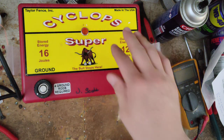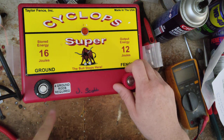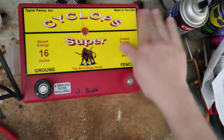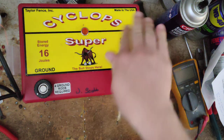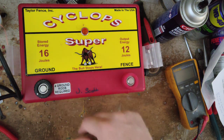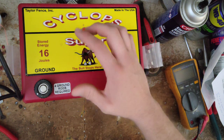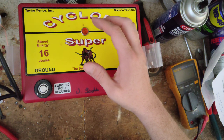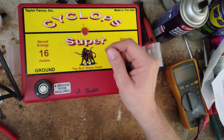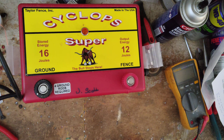These are pretty good units — we don't get them in that often. This particular one is a 2020 model and I think lightning got a hold of it back in the fall. They do have some good lightning protection on the inside: they've got a surge protector board on the AC side past the fuse, and an output protection board for the fence and ground side. Later versions — and even older ones — have protection components across the capacitors to help protect them from lightning and keep the longevity on those capacitors.